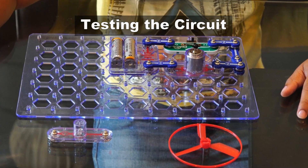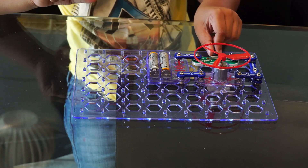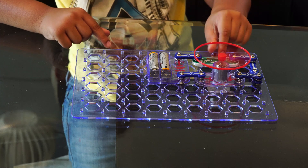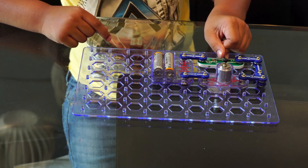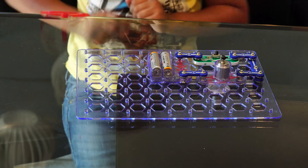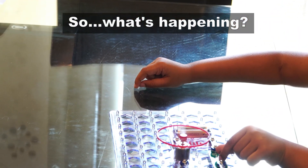We are now ready to test our circuit. Are you ready for it? Turn on the slide switch to the on position. If your circuit is correct, the fan should turn on. Press the switch to the off position and your fan will fly towards the top. The air is being blown down through the blade and the motor rotation locks the fan on the shaft. When the motor is turned off, the blade unlocks from the shaft and is free to act as a propeller and flies through the air. If the speed of rotation is too slow, the fan will remain on the motor shaft.